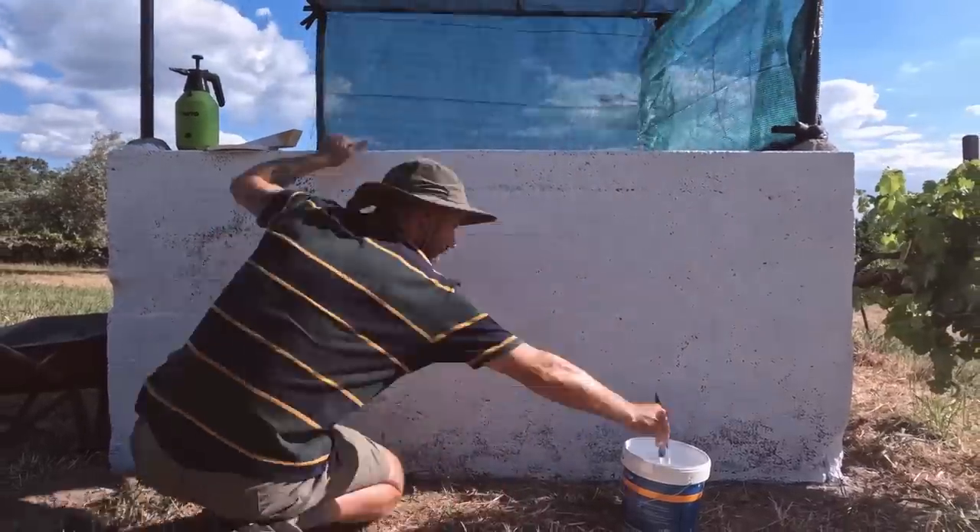It is dry enough now to float. This is definitely an unnecessary step for this bench in this tank - realistically it doesn't need to be dead straight and absolutely plumb and level - but I've never rendered before and we might end up doing rendering on one of the buildings. This seemed like a good opportunity to do all of the different steps and learn what to do more of next time. With the floating process, it shows you where the high spots are and where the lower spots are - the darker areas are where you've been working it with the float, and the lighter parts are where there's a dip in the level. So you take a bit of render, fill it in, work the float. I've opened a can of worms now, so let's just keep going and get it done.